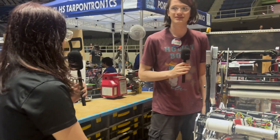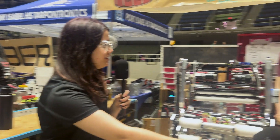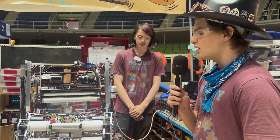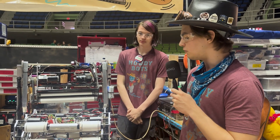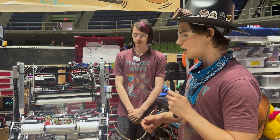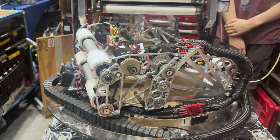That is some super cool stuff. I saw a little bit of y'all's work from the Waco competition during week one and things do look a little bit different — how do you think about that? We hit the shop hard over spring break. At the week one competition, we were feeding from the source into the shooter and we had a fixed angle. Our V1 angle change was not working the way we wanted it to, so we had to do a full revision of the shooter. We went from a cam-driven elevation system to a rack and sector gear-driven elevation system.